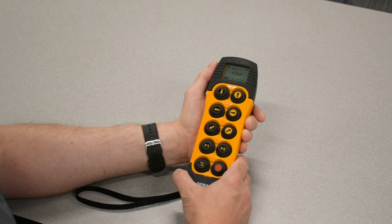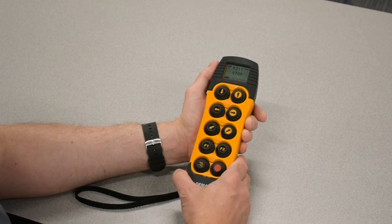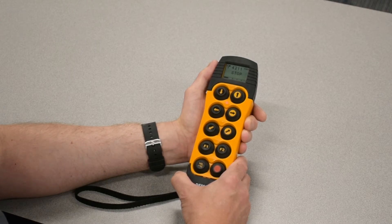Now we are going to show you how to access the parameter menu to create a four-digit identification number for the receiver. In this case, our starting point is a pre-existing receiver that's already been named 4211 in coordination with the crane serial number, that being the last four digits. We're going to change the name for this example to 4210.